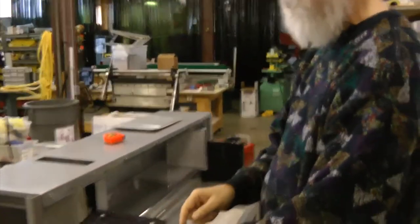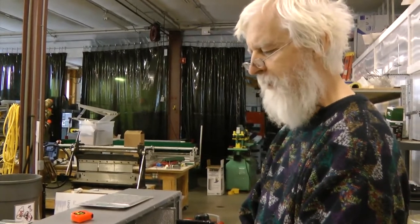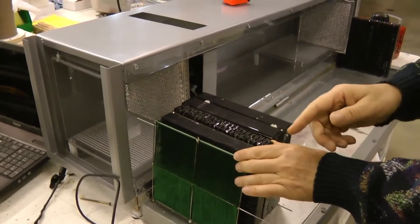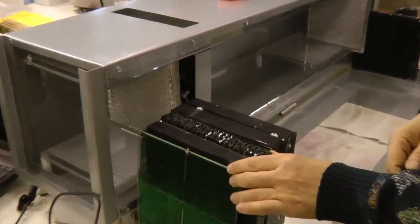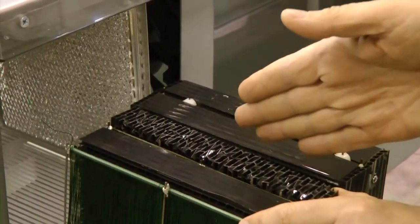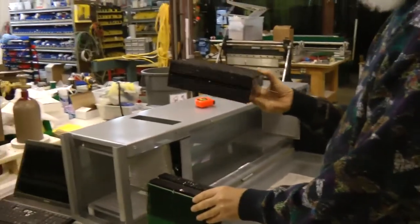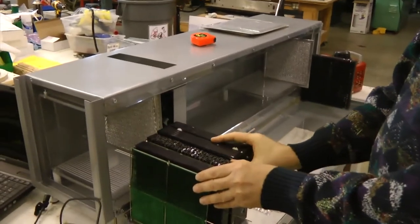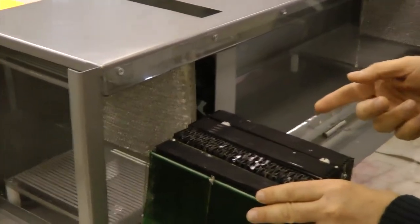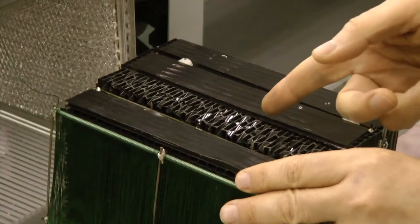It's going to be as tight as our control loop can make it. Coming in, it's already very, very tight — better than a tenth of a degree. After that heater raises the temperature by around one degree, we sense it again with a baffle-sensor combination.